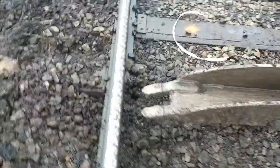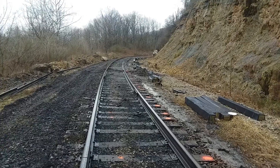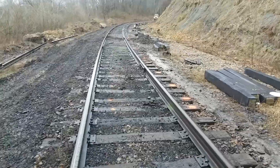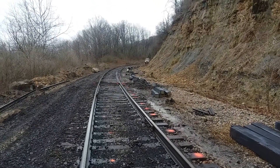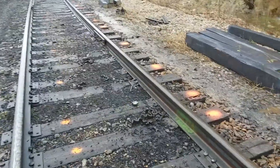We got a good bit of work done yesterday. This is what I started this morning — I don't have anybody to help me this morning; everybody's down there on the rail gang. That's my cribbing bucket. Down here we got an apprentice loader; they're putting in more new rail. This is all new rail over here. On this low side we got about 1,200 feet. Yesterday we probably got 400–500 feet of new rail laid — it's a pretty good day. They've got maybe 400 more feet to go and we'll be done with the rail on this curve. Then we can free up all those guys down there to start putting in these ties.